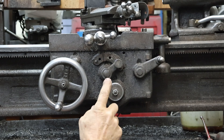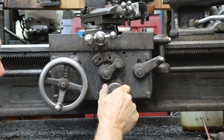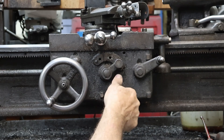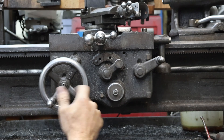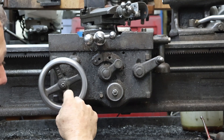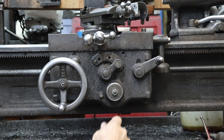I've also shown this assembly when I disassembled the other Sheldon lathe, and I'll link that up in the right-hand corner of the description so you can see it. With this loosened up, we can now turn our nut. We're engaged there, but we can loosen it to where we can traverse it again, whether longitudinally or cross-feed. So this is an adjustment here.